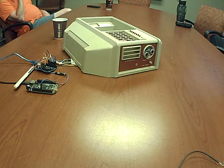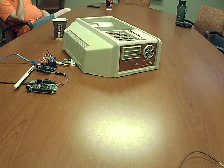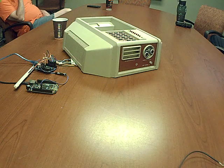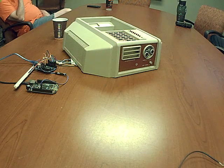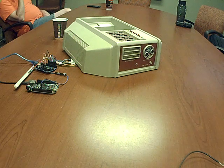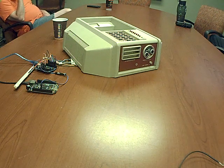And if you look right here, I can use the hardware serial port to output to the console. Debugging, yeah. But once it gets set up, there's where it sets up the my serial. It goes into the loop and it waits for the keys. If no key gets pressed, that's fine.